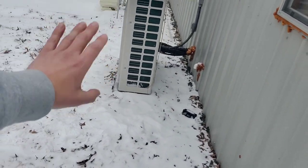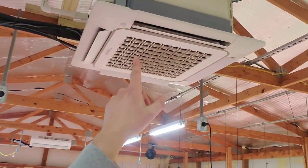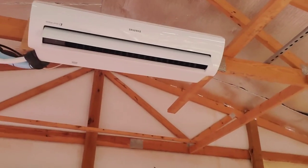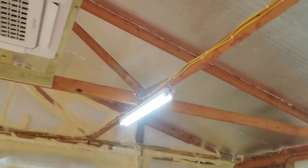This is a different type of system, and I'm going to show you what the indoor unit looks like so that you guys who have this type of system know what to do. This is one unit that goes to that outdoor. This is a four-way ceiling cassette — it does not have emergency heat. This is a wall mount air handler, and it does not have emergency heat either. It works off of the compressor. When the compressor runs and builds up enough heat, that indoor coil reaches about 99 degrees, and then the indoor fan comes on. This four-way cassette works the exact same way.